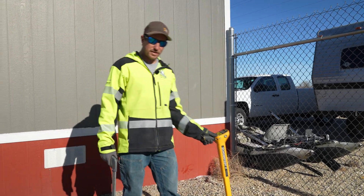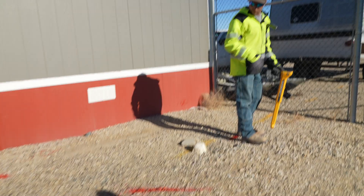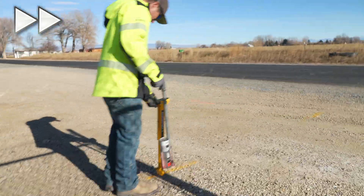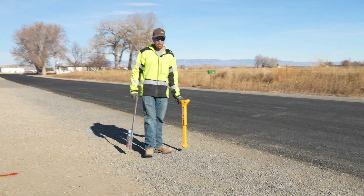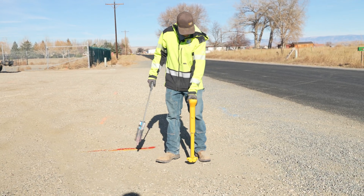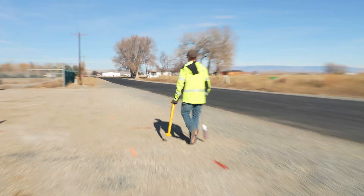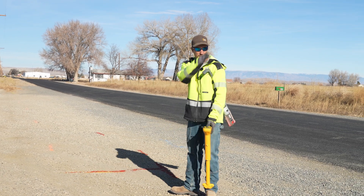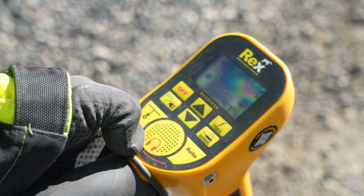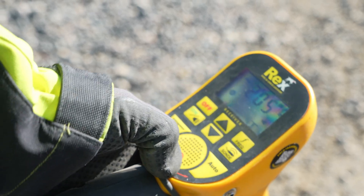I'm getting a really strong signal — a 999 on my readout. I'm a little bit to the right side of their locate. We lost it — it goes this way, so that means it goes that way. It's safe to say that the gas line does come to a T and this is where the service line runs. What we're going to do now is push this line with an arrow down right here. It's telling us two feet, two feet five inches from the top of the ground to that wire.